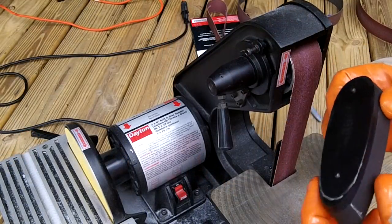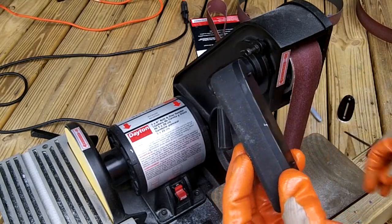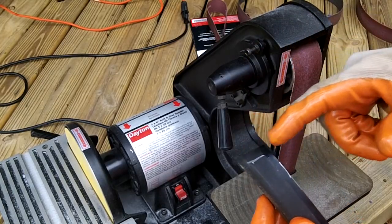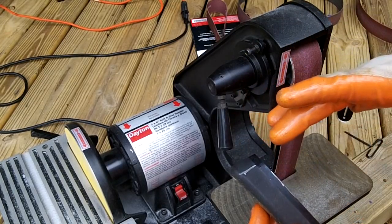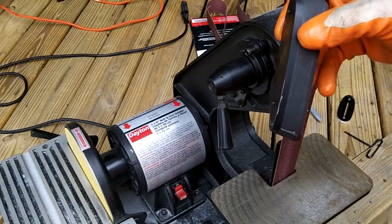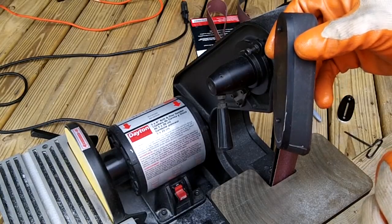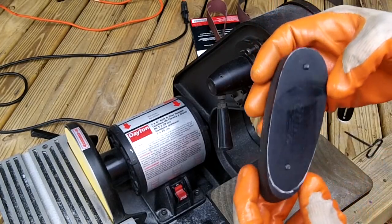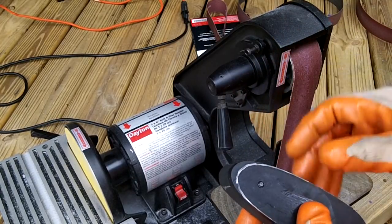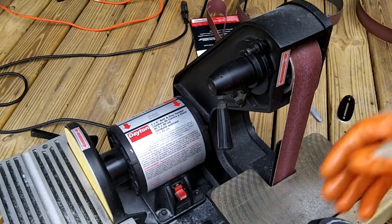Okay, we're back with our frozen recoil pad. It's thawing quickly though. We've marked this line here that we care so much about. This is our angle of the bottom of the stock. We want to make sure that angle continues throughout the butt pad as well, because it makes it look good visually to the eye. We've scribed our lines, and we've also used our marker to have our rough cut. So we're going to go ahead and start grinding this bad boy down.